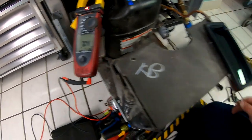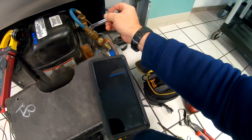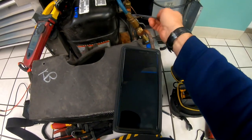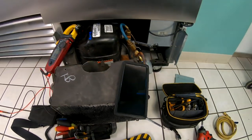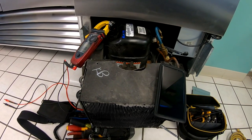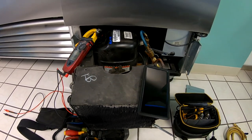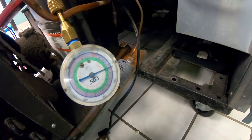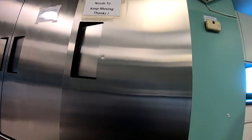Amperage is coming down. We could cheat and restrict that flow a little bit and see how it does. There's closed, there's a few turns back — this is not very scientific. There's not a whole lot else you can do. If it does freeze product — and they did say the product wasn't freezing very well — then you come back to the situation of: do you say it's time to replace it? Because even though it's in decent shape, it's just getting older.